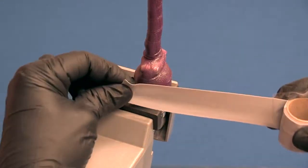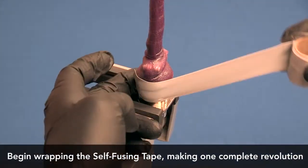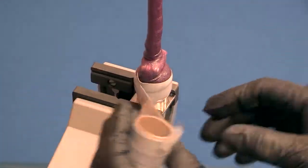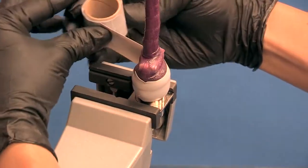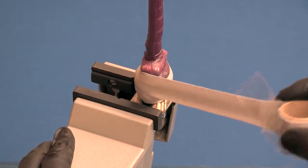Begin to wrap the connector behind the coupling ring or nut with one complete revolution on itself. After the first full wrap is complete, continue wrapping with a 50% overlap over the top of the stretch sealed tape. Use the line in the middle of the self-fusing silicone tape as a guide and remove the release film as required.